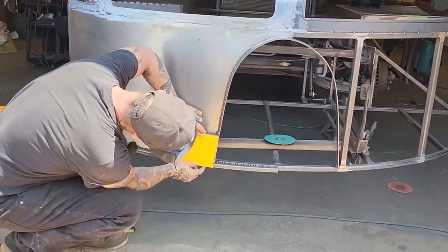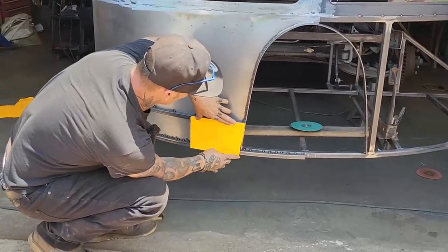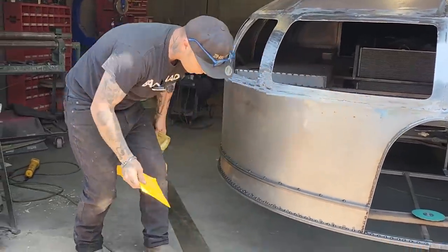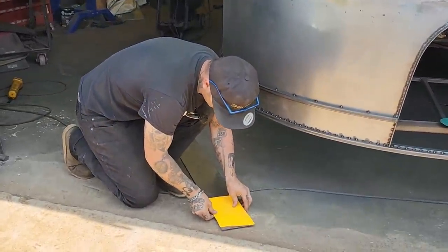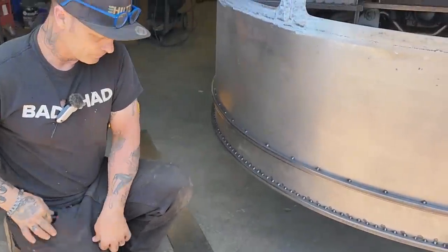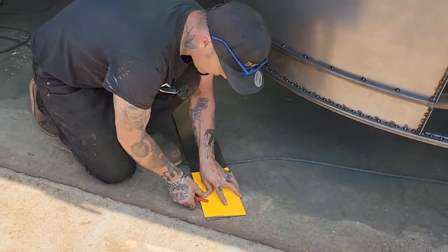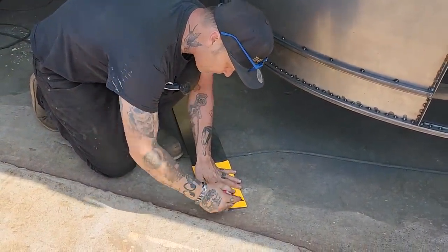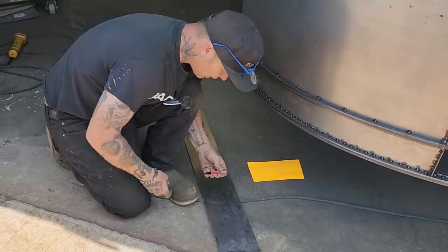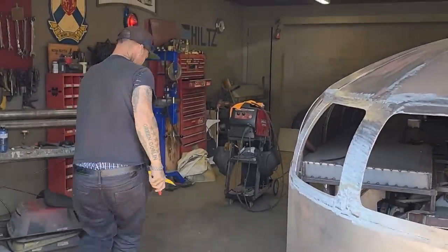I appreciate it. I'm thinking that that's my shape right there that I want. I could weld that piece down along that grill really nice there. That'll be fine. It would be hard to find that angle if I did not do what I was doing. So we're going to take that. We're going to apply that in there. Pretty simple process right there, was it not, to find that angle? Simple. So simple that anybody can do that. Anybody? Yes, anybody. So we're going to cut that off there. And we should know, or I'm hoping, that that will fit that, which I think it will.